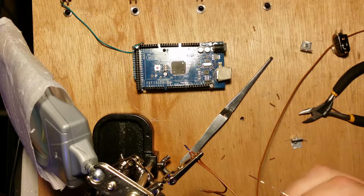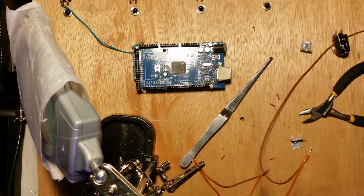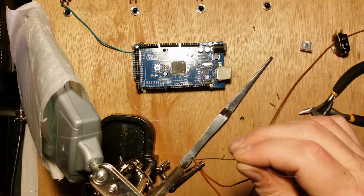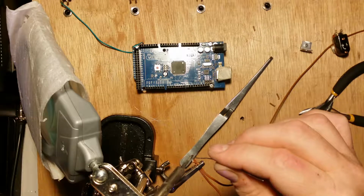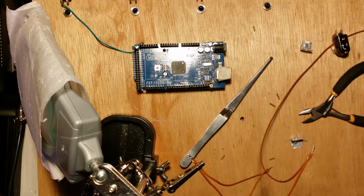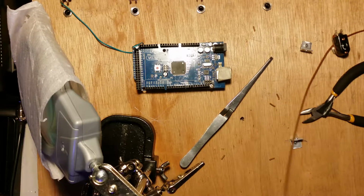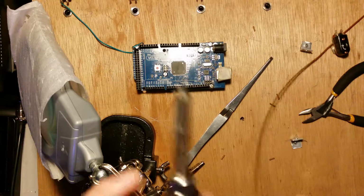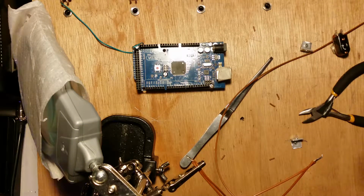Before I had this fancy unit, I had one control on my soldering iron that was on and off. So I'm still learning about temperature control for soldering, but see, I'm going to take that back up to 415 because that was a little slow there. If I was soldering a component of some sort, I probably would have melted its insulator. Okay. Let's just check we're still in focus there. Very good.